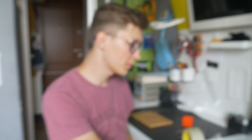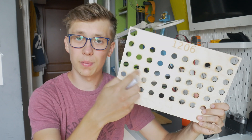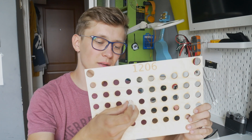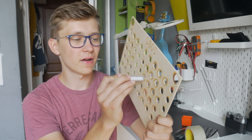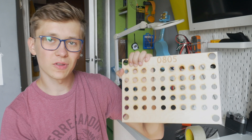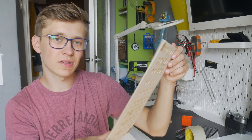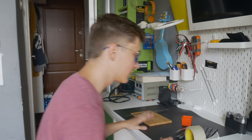It's another day and I've been working on the stickers and sticking those to the test tubes. The holes are a little bit too small for the test tubes with the sticker — they were perfect without the sticker but with a sticker it's a little bigger. So I grabbed a file and sanded it down a little bit so that it fits perfectly now. I'm not sure if I like the not-so-perfect look of those holes, so I might end up cutting this again on the laser cutter.